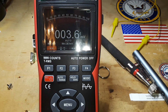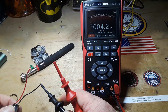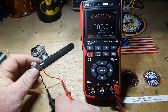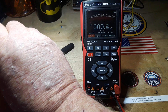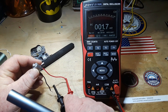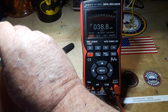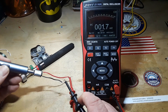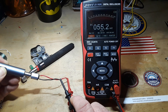I soldered a couple of wires on here — they were not exactly cooperating, but at least I should now be able to connect wires up to this. I'll just use this little screwdriver to spin it. At that speed we're getting about 30 millivolts. Maybe 50, maybe 60 millivolts — and there's no way you're turning that crank that fast. That was kind of fun.